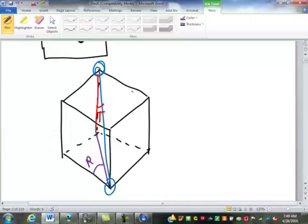Right, but no matter, just as long as the... You couldn't keep it square. You want, see I put this pen through the hole, you want that pen straight up and down. So you just drill right through it. Right. So you've got to rotate it first, so that now when I do it this way, I'm just turning that line, rotating it in the plane. So you've turned it so that it's in that plane that you're working in. So now you tilt it, and now that line's straight up and down.